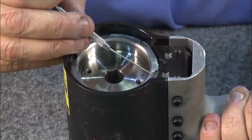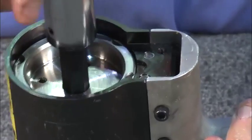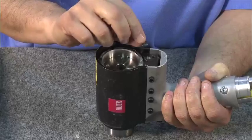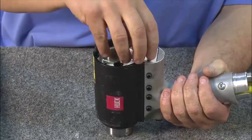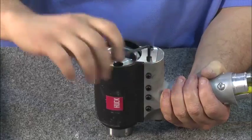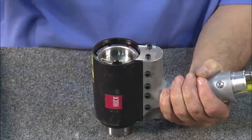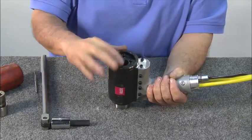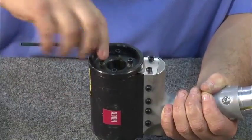Next, we'll adjust the back cap to line up with the scallop hole. Reinsert the wrench and back up the back cap until it lines up. Reinsert the retaining disc. Replace the retaining plate and the plate screws. Tighten with an Allen wrench. Now replace the end cap cover. Rotate it until you feel the screws fall into place. Using an Allen wrench, screw them in until they're tight.